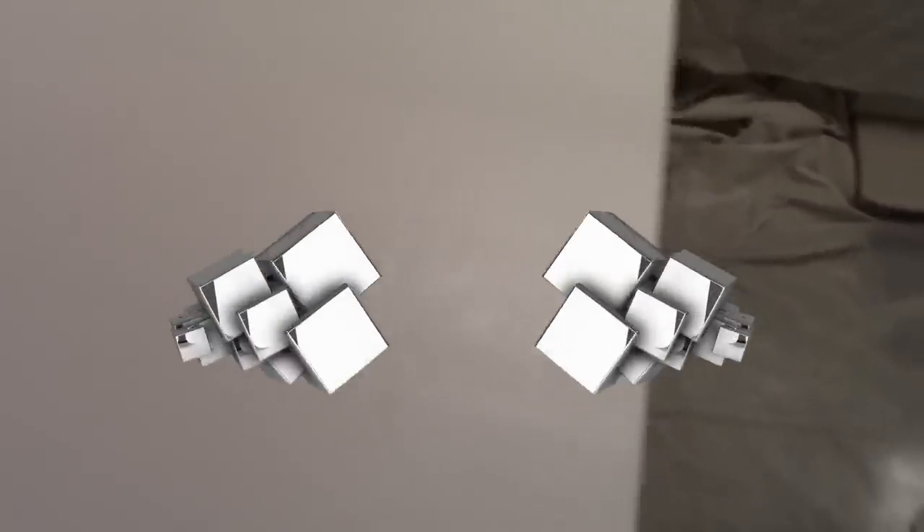Here's what we've got after the first coat of finish. I don't know how well it's showing up on camera, but you'll notice the tiger striping going on. That sprayer kind of pulses — each time the motor makes a revolution or pressures up, it kind of tiger stripes. But for a latex finish, that's just fine. That's not going to show up when it's dry, and it's certainly not going to show up with the second coat.